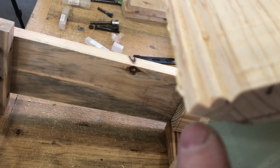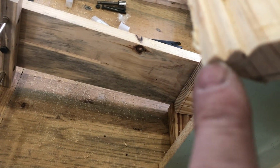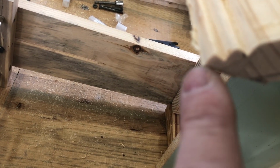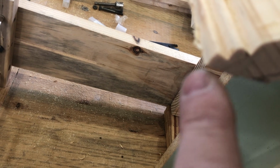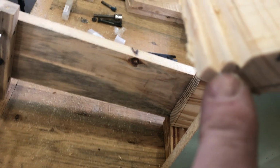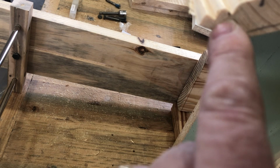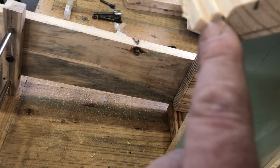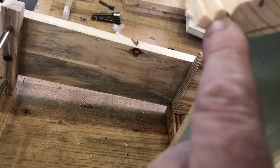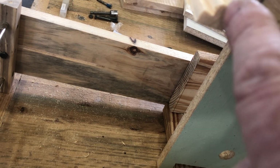So that's what the bead looks like after cutting right down the middle. And it looks like that was too little. Where I had set was, I tried to go 15 millimeters from valley to valley, and that's what this cut was. Then I went halfway, roughly 7.5 millimeters from this valley to this valley. So it looks like what I should probably be doing is something a little closer to 10 millimeters from valley to valley. So I'm going to do that again.